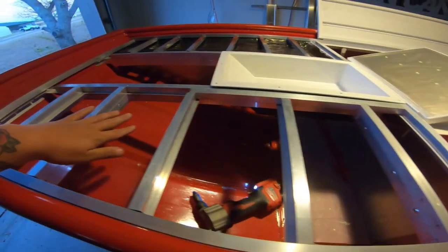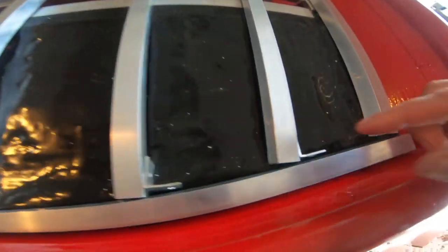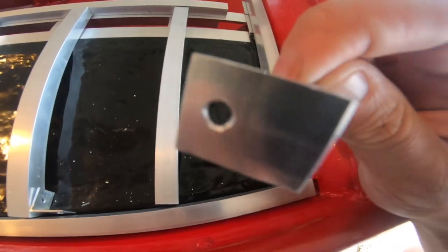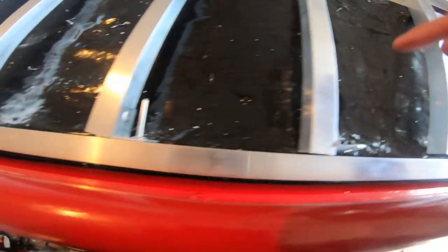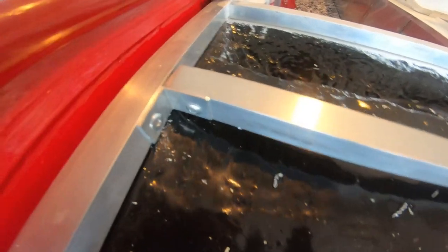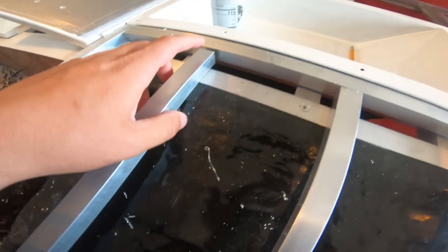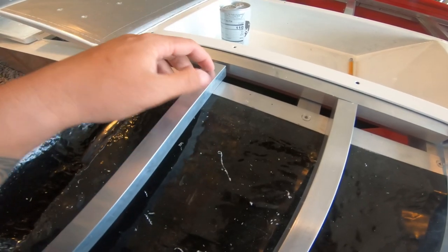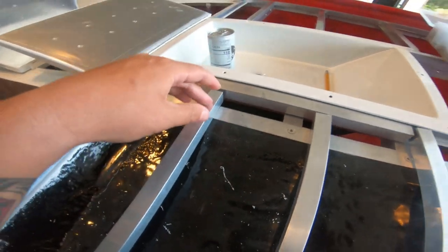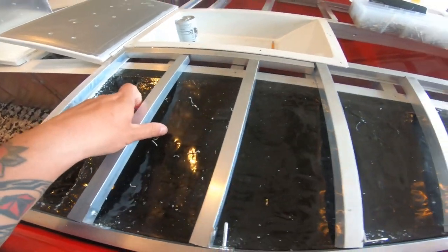There is all of this side connected besides the front. To attach to this side, I cut out seven of these pieces of one-inch angle, drilled a hole through each side, and also bent it so it matches perfectly inside that corner. I already got one installed just to test it out — that is how I'm going to be connecting these braces to the frame. Over here I need to drill a hole into this and then go from the underside and drill up into the square tubing, then rivet that into place. So I need to drill these holes out first before I get them all secured down.